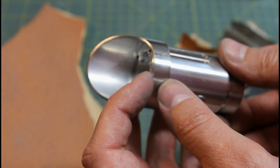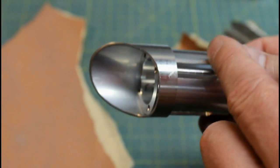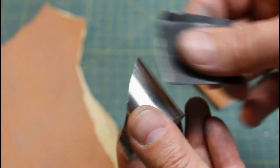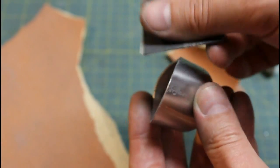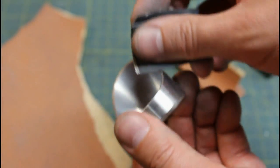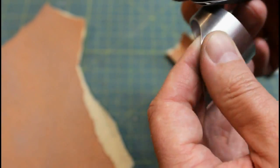I want mine to meet flush with that. I'm going to drill some holes to mount it with set screws that put pressure from the inside of this piece, so all you see is a little hole as opposed to a big bolt. To finish off the piece, I take my folded-over sandpaper and very gently — being careful not to brush it against the finished aluminum that you took so much time to polish — just go around the outside edge. As you've probably found once you've tried this a couple of times, little jagged edges and slivers of aluminum are not cool and not part of a finished high-end lightsaber. So I want to take some time and do this, and then my part is done. I'll want to do the same thing with the outside of this as well.